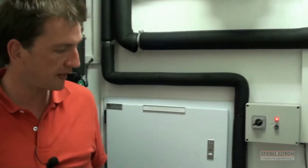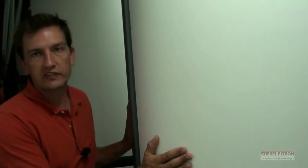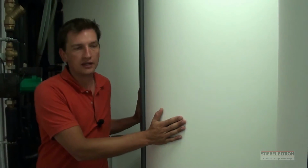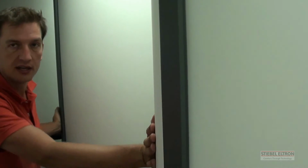Let's go a little bit further back. These two big tanks that you see here next to this domestic tank are for the central heating. This is your warm tank. We call it a warm buffer tank. This is your cold buffer tank. Now, depending on the temperatures and whether we're in the winter season or summer season, this heat pump, via sensors located inside the house and sensors outside the house, will work out whether the house has to be heated or cooled, depending on your specifications or whatever you set on the controllers.